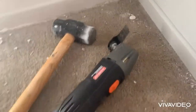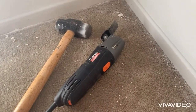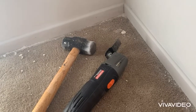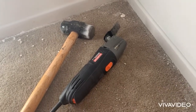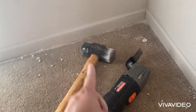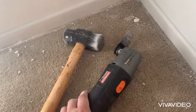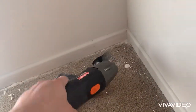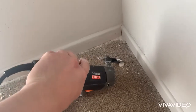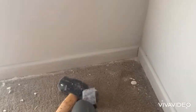Another method is you take an oscillating tool with a drywall cutting blade. Usually after you use the cutting blade for four hours on drywall, it gets very dull and there are no teeth at the top. So if you have a dull drywall cutting blade, you would just use it and vibrate everything and remove it in a similar fashion.